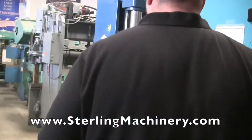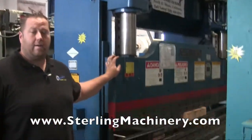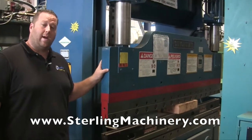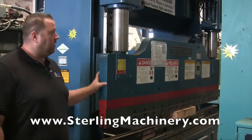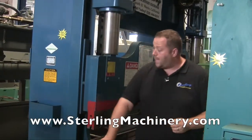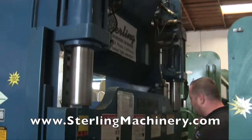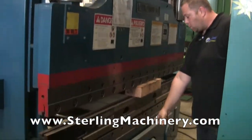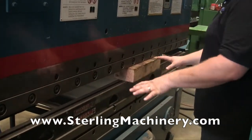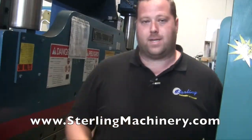So you have an up-acting, you'll have the guillotine style, and then you come to a standard double-cylinder like this Cincinnati right here. We sell Cincinnati new and used — all different types of brakes and shears as well as lasers. Cincinnati is one of the best American brands, been around for a very, very long time. Basic design: two straight cylinders come on each side. This particular one has crowning — what that does is allow the bed to move and make sure everything's going to be flat, so you have a nice flat bend every time.